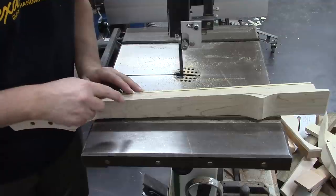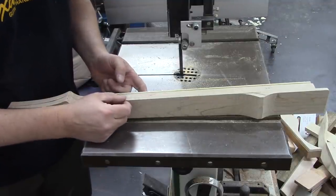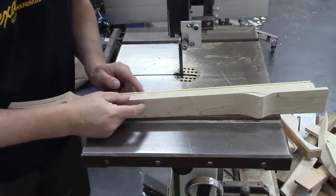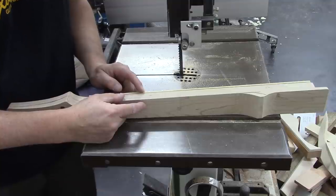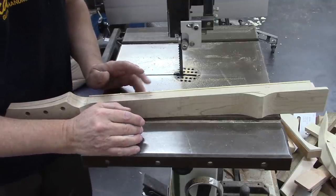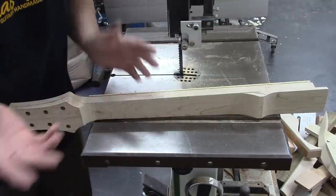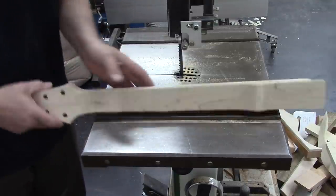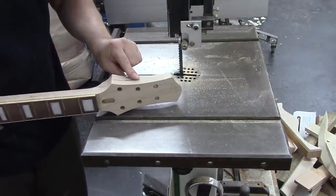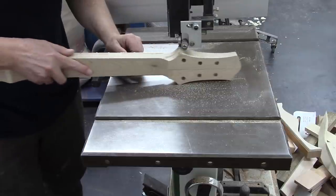I forgot to mention that if you want your neck to be more than one inch from the top of the fretboard to the back of the neck, one inch is going to be not enough. So you need to remember to do this to the dimensions of the neck that you want. It is rare to find a customer who wants a neck that is over one inch, but you guys might like big necks. Next thing we've got to do is cut the back of this off the headstock — same tool, same action.